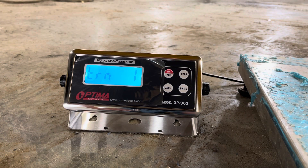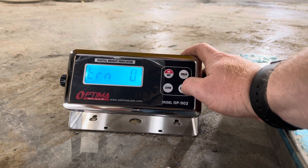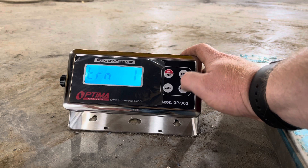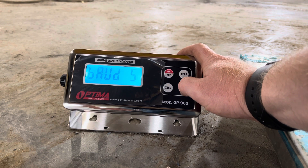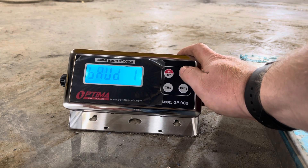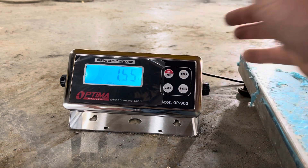This is your output communication mode. I have it set to one — continuously send. Three is command mode, two is manual send. Then your baud rate: one is 9600 baud, five is 600, four is 1200, three is 2400, and two is 4800. I usually have it set at 9600 even though I don't use it on these — it's what I use most on my other equipment.